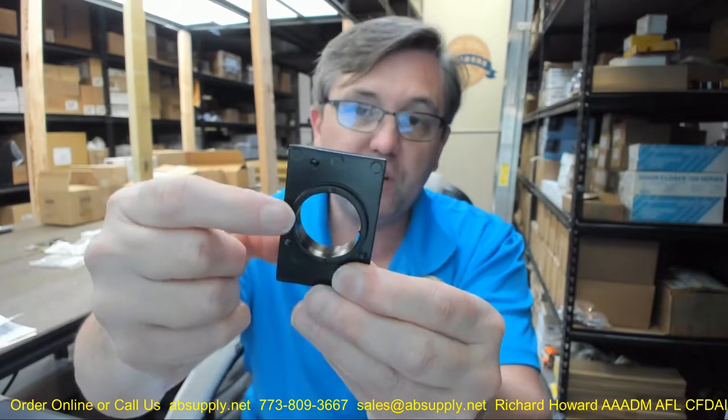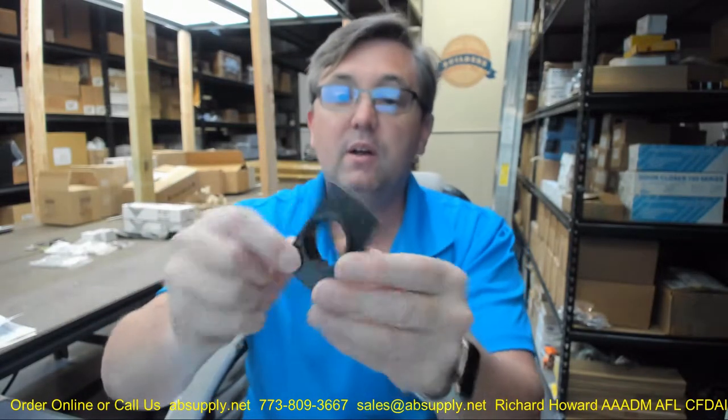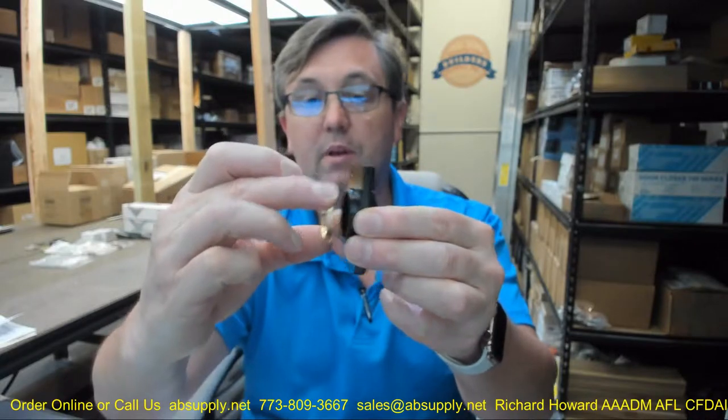And you're going to get with that the cylinder nut or the cash box ring, sometimes I call it, so that when your typical 1-inch mortise cylinder goes into the exterior mounting pad, a couple of little features to the cast aluminum here keep that cylinder straight. You're then going to tighten it down to the unit, so now you've got a consolidated assembly. You use a standard 1-inch mortise cylinder with an MS, Adams Rite style cam.